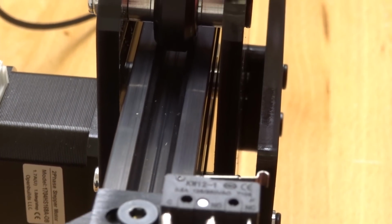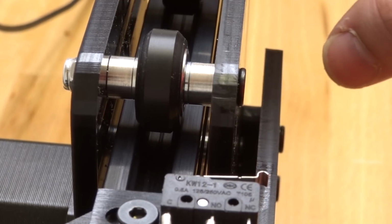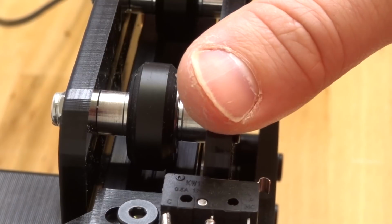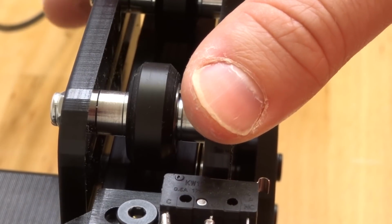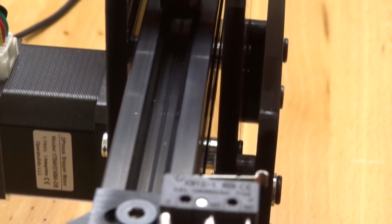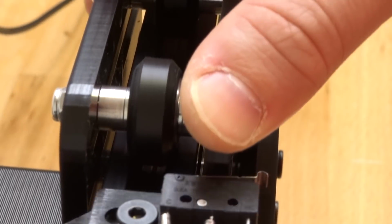So ideally what you want is interaction between the plate and the microlimit switch to activate the plunger on the microlimit switch. So as you can see, the pin is activated at the max point. So once it releases the plunger, you'll see that the pin reactivates. And that's exactly what we want. We want that interaction here between the microlimit switch and the plate. You should hear that click, and that's precisely what we want. Okay, so let's move forward.